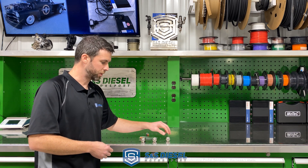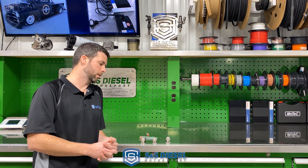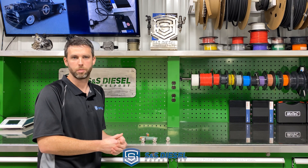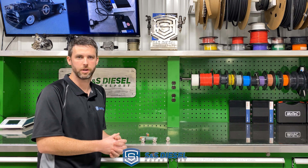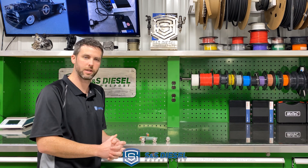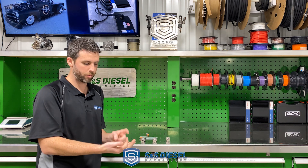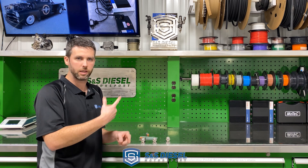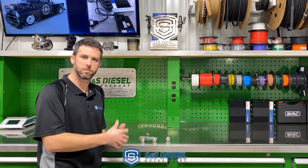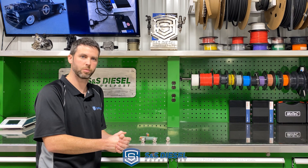All of these sensors are set up with an eighth-inch NPT pipe fitting on the threaded end. That's a pretty widely used size — your engine, piping, or fittings are probably already eighth-inch NPT, or adapters are widely available. These are a great option for any kind of data logger systems or anything you need to measure pressure. They're all 5-volt supply — three pin: a 5-volt supply, a ground, and a signal back to your data logger, ECU, or whatever it is. If you've got any questions, let us know. It's a great product for anybody needing to collect pressure data accurately. Thanks.